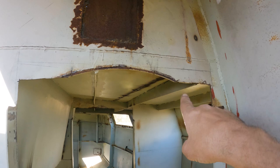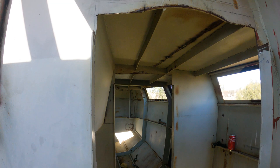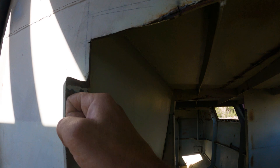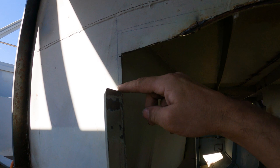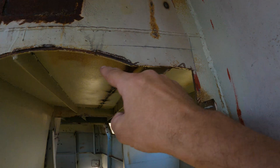So we did cut this arch out not long ago, and we don't have any door framings above here now. So I need to basically extend this 50mm by a 3mm bar up so far. I want the door frames to be 184cm. So I may have to duck, but most people don't. So we'll just extend that 50mm, square up the top, put a bar across the top and do the same.